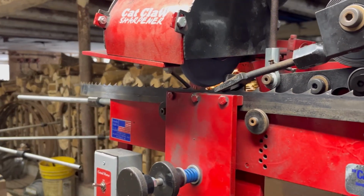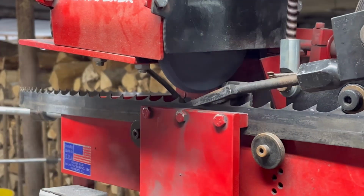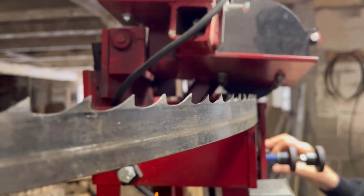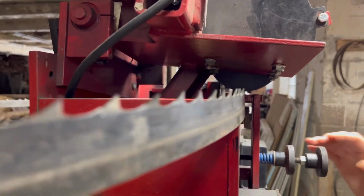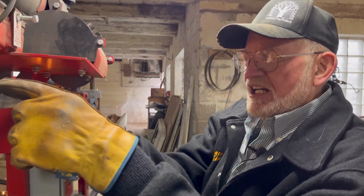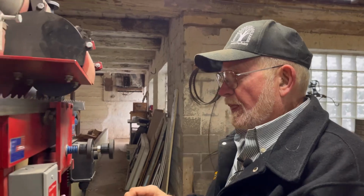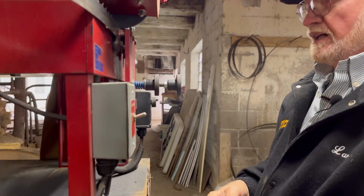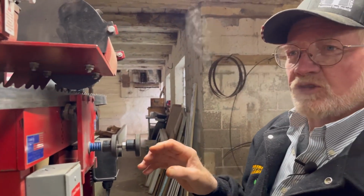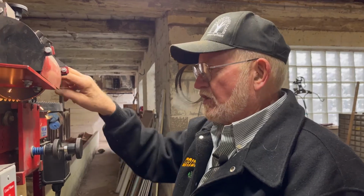Speed that up, and it depends on the blade, the stretch, how much space there is between these teeth. Sometimes I might go around 3 times to get it just like I want it. But that's okay. And I don't try to go too fast, because I think if you're hitting it too hard, you're putting a lot of stress on your stone.